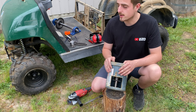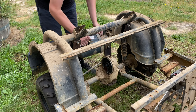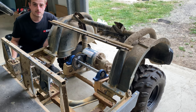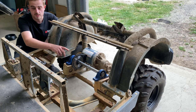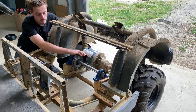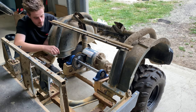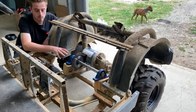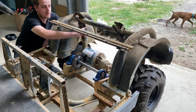I'll bolt this up now and I think we'll get that jack shaft and roughly mount it somewhere — I've got a little bit of chain there, about three metres of it, so we'll try and make something work. I've got the use of a shed at the moment because it's raining outside on and off, so I've brought this in here. I've mocked up this shaft with two bricks sitting there at roughly the height where it's going to sit — I will drop it a little bit lower. As you can see the chain just slightly rubs at the top and bottom, so I'll probably have to cut a hole on the other side so it can exit at the bottom without rubbing. What I'm going to do is weld up a couple of little supports and sit the pillow blocks on top for now, because I don't want to weld anything too permanently until I get that motor sorted — that could take a couple of weeks. I'll add just a brace in the back while I've got the welder out so that they don't keep moving.